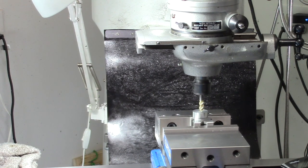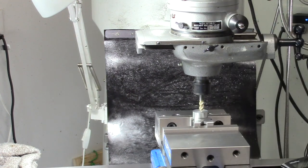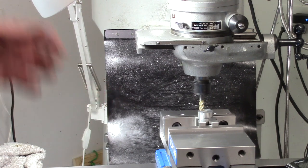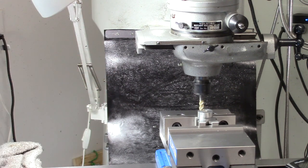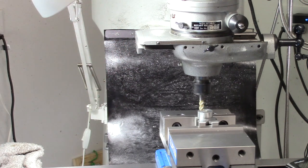We'll go over here to 435 on DRO, which I know you can't see. We'll touch off. We need to go about 200 thousandths deep. It doesn't really matter on our test piece. Obviously, the real one will. And then we'll just traverse this side, move over, traverse the other. Then we'll try the interesting bit, which is the rotary milling, and see if we can put those radiuses on there in a fairly easy manner. So, here we go. This will be 1300 RPM or so.